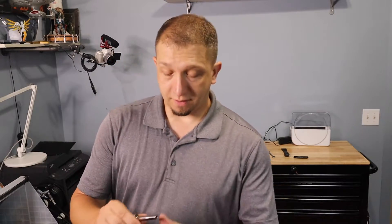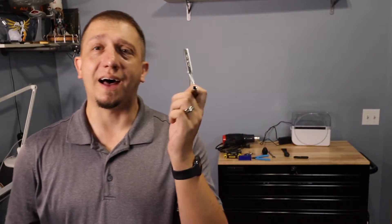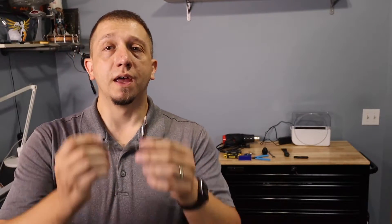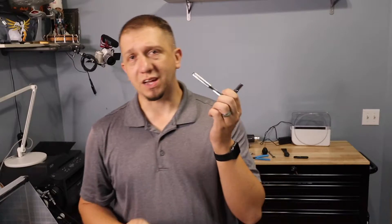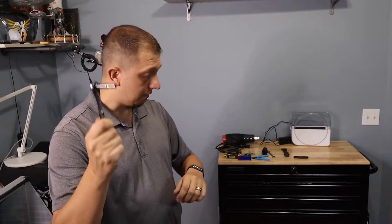The second thing I'm going to talk about is the 6mm deep socket, which I love for my Ender 3. This thing is great when I'm taking off a hot clogged nozzle. I can put it up there, keep my hand away from the heat, safely get the nozzle out, and drop it somewhere to cool. Then I can use it to easily put the new nozzle in, keeping my hands away from getting burnt. I use this a lot because I change nozzles probably more than I should, but nozzles are cheap and I'm kind of lazy sometimes.